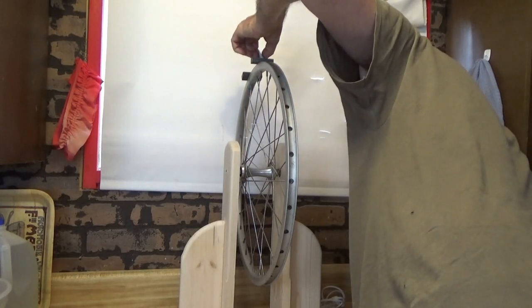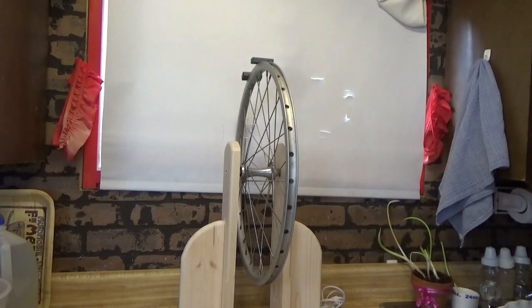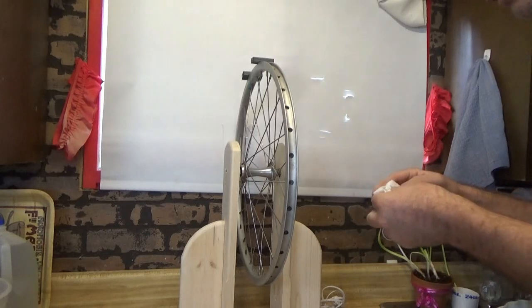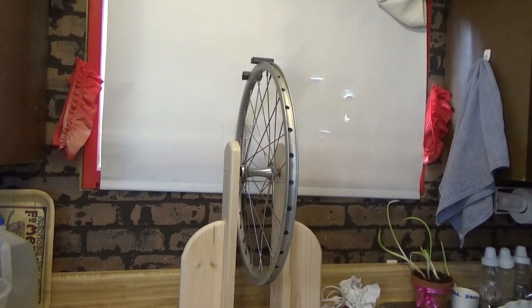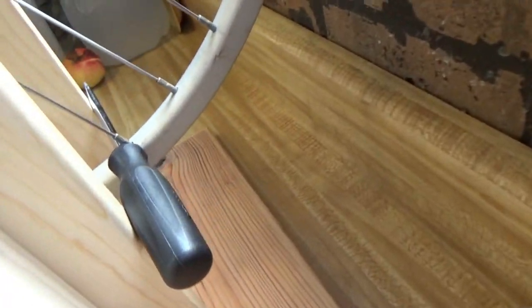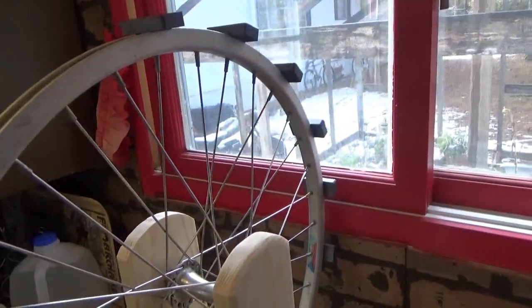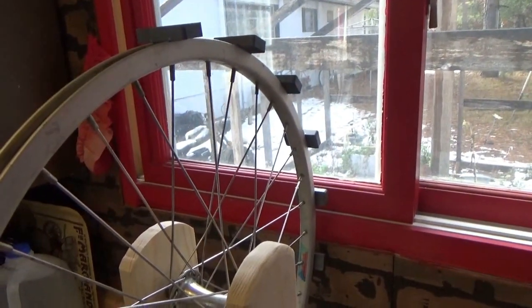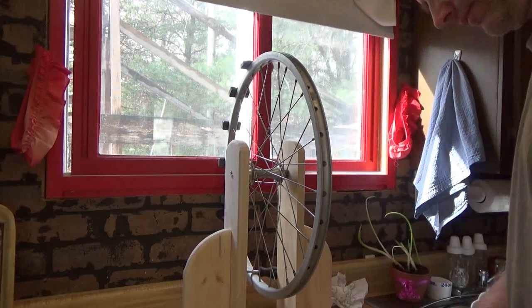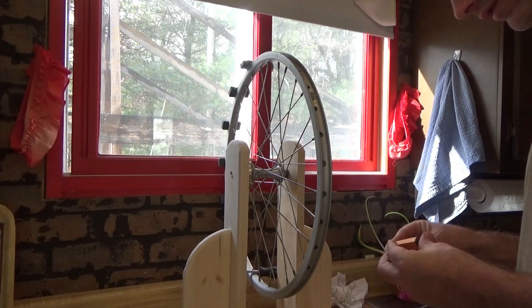It's awkward to do this at an angle. A little extra glue came out and I just don't want to throw off the weight. That stuff sticks — it got right to my finger. I've got a few magnets on now. I'm using a screwdriver to hold the spokes against the frame and stop the wheel from spinning. Now I can get a magnet at the top position without it sliding and spinning on me. You can see the magnets repelling each other a little — even these weaker ceramic magnets at that distance, you can feel them trying to fight each other.